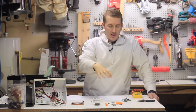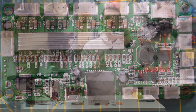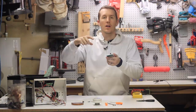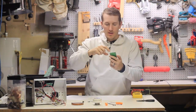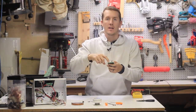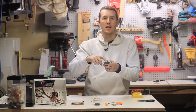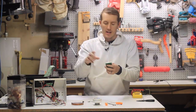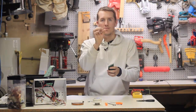So I looked at the circuit board - I opened up the case and looked at the circuit board, which is this small thing here. I found where the power for the hot end comes from, and it's on the end here. There's an A and a B, two plugs for it, with the same red braided wire going to it. And I looked and there's another plug right next to it that's for the heated bed, and it's the same plug.